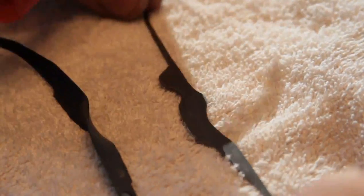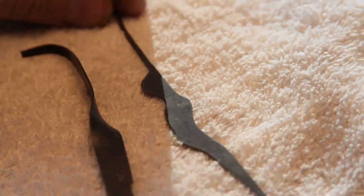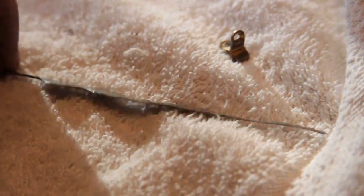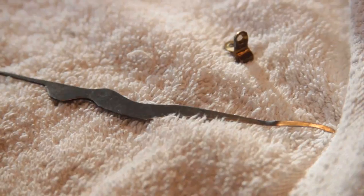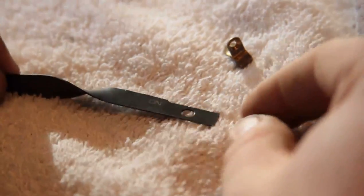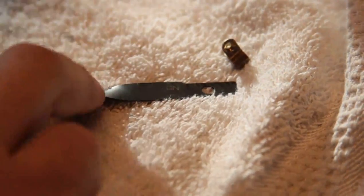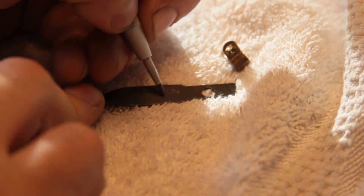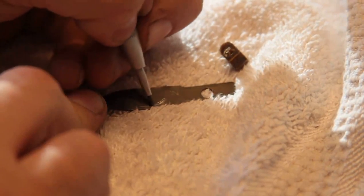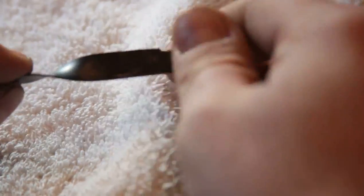So when you're working these things and you want to maybe make a mark to trace an outline of something for when you're going to go mill it — you need something that can actually cut the steel. I'm not going to do it on that because I like that pick. I'll do it on this piece of metal. Let's say I wanted to cut a short hook on here — I can come in with this scribe and scribe a line, because it's very sharp and very fine.